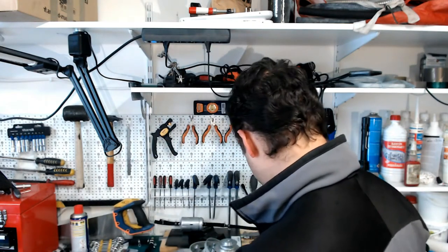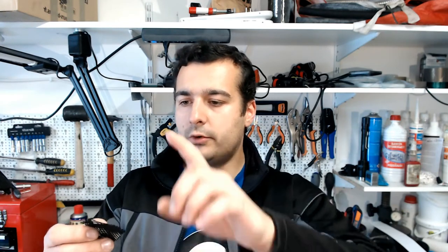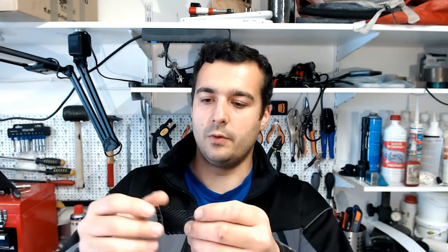Let me give you a short insight of what kind of carbon fiber you can use in your projects. You've probably heard already of fabrics like this plain weave — this is typically what you get from carbon fiber shops. You can see all the layers that have been intertwined, one tow going over and under the following, and this is what gives you this fabric texture. This is a bidirectional fabric — you have the warp in the 0-degree direction and the weft in the 90-degree direction, so this means it's an orthotropic material with properties aligned in 0 and 90.